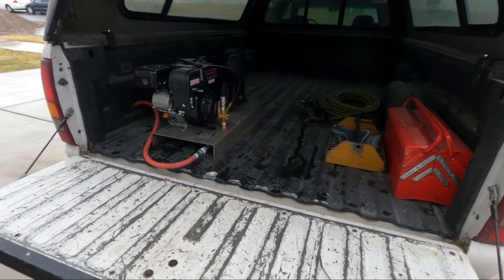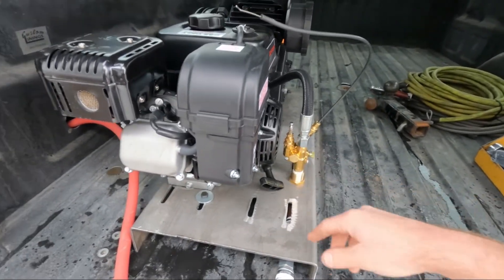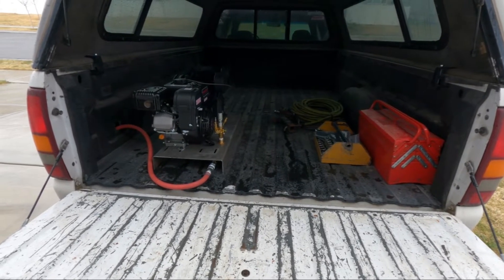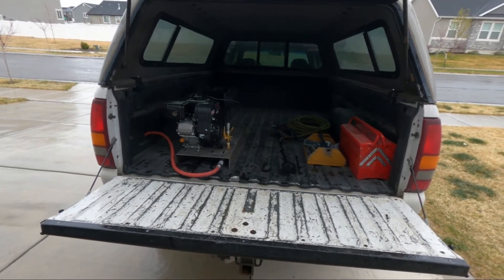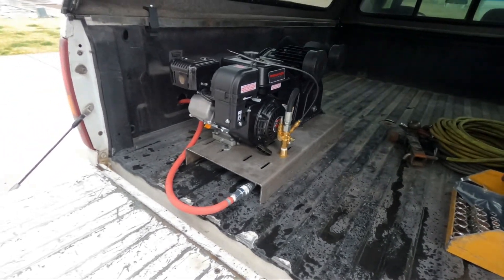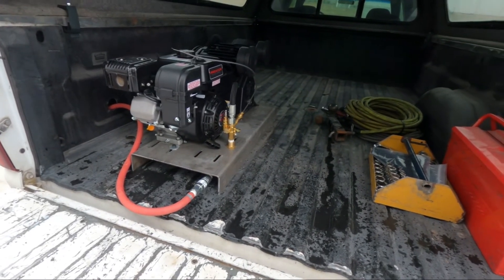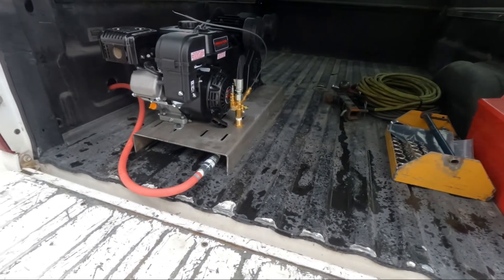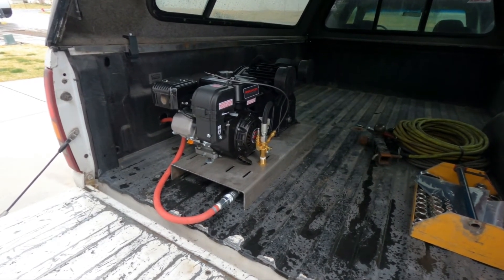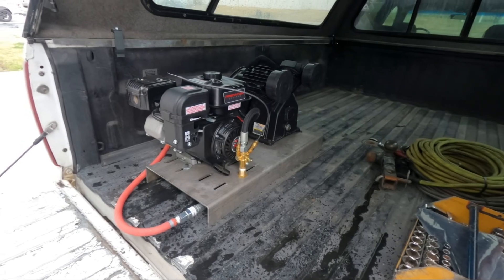It flows pretty good - it cuts in at 100 and cuts out at 110 psi. I need to tinker with that - you can mess with this right here to get it to come in at 90 and go out at 120 or wherever you want it. I still need to get a gauge bracket for the truck. It's really simple to make - if you wanted to you can weld that plate to a tank. I figured the tank's gonna be in my trailer and I've got tanks on the truck, so this makes it nice that I can just unbolt it - two guys can lift it easy - slide it in and out. The quick connect makes it nice. Hope you guys enjoyed this - it was really cheap to build. Like it, subscribe if you haven't already - let's get this channel to a thousand subscribers.